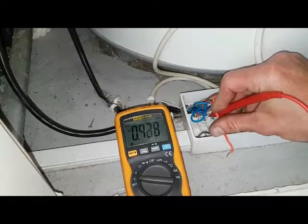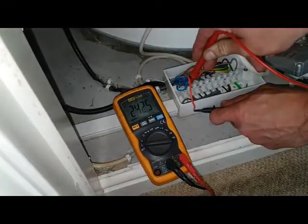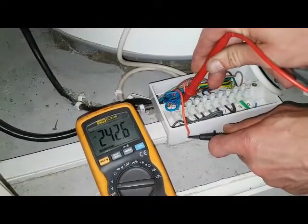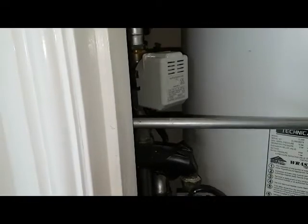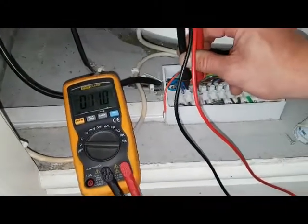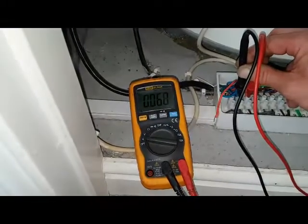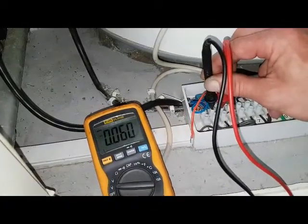Now we're going to turn the power on and see if we get 240 on that wire. As you can see there's 250 volts on that orange — that's the culprit. That permanent supply has come from the Drayton valve and that's what's bringing on the boiler. We then tested the other motorized valve across the other orange wire and you can see there's very little on that one, so that one's okay. This Drayton valve on its own is the culprit.